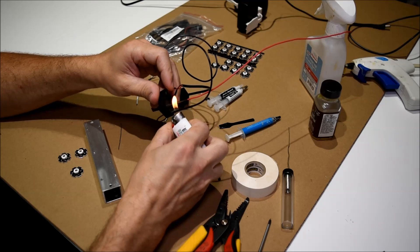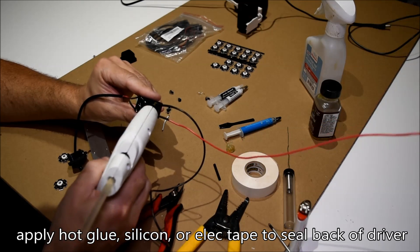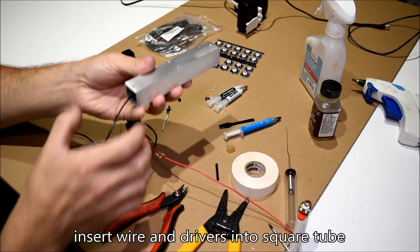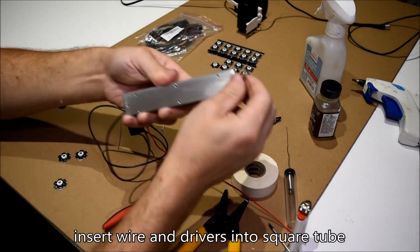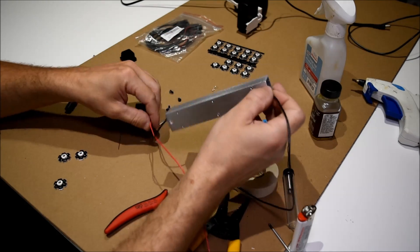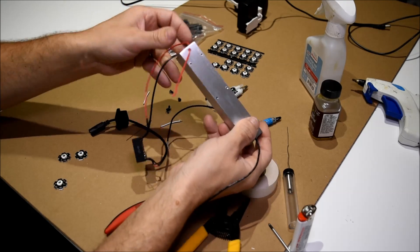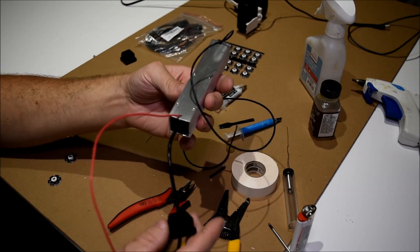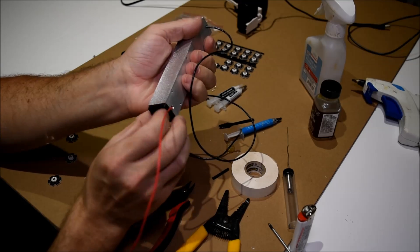I'm attaching two DC out leads — this is going to go to the LEDs themselves. Very simple wiring: we're using series wiring, three LEDs positive to negative, positive to negative. If that's confusing to you, you may want to do a little more research, because series wiring is incredibly simple once you get it straight in your head. I want this thing to be neat and clean and enclosed even though I'm spending less than $20. So at this point I've got the DC in from the cell phone charger and two DC wires out — positive negative in, positive negative out.